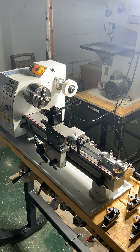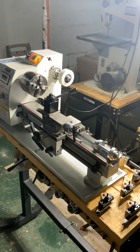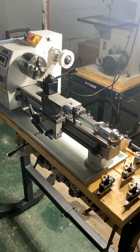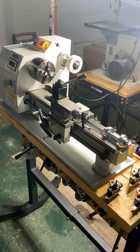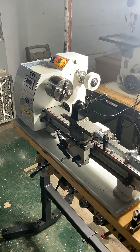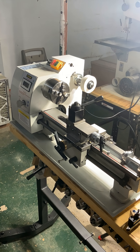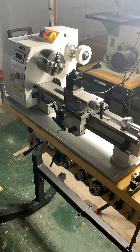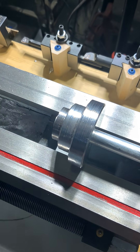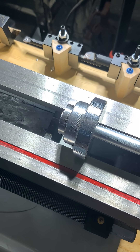I've pretty much well completed my mini lathe project here. I ran into one other problem, and that's vibration. These things don't have a lot of weight to them. The bed there is hollow, so it reverberates through there quite a bit. So one thing I did is I changed a three-jaw chuck out to a four-jaw self-centering chuck — it's heavier. That certainly made a difference. And if you look at this little barbell set I made, you can see the little striations in there. That's all from vibration; it reverberates down through your tool.